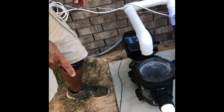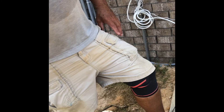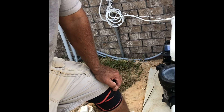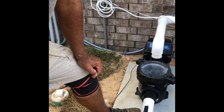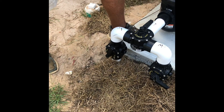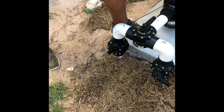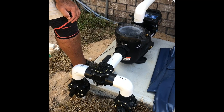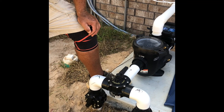You'll start to see that thing bubbling up and hissing. Either the water's too low, or that's the reason why we put a valve on the skimmer. My recommendation — let's go ahead and turn your pool back on. If you're leaving for a week and you have no pool service or anybody to watch it, this is what I do to mine. I put my skimmer barely open when I go on vacation. The reason being is because if the water gets down below my skimmer, my pump will still pull from the main drain, but it's not going to be a big hissing noise in my skimmer, and nothing else is going to get sucked in there.